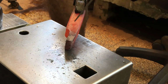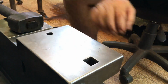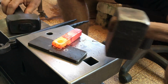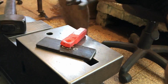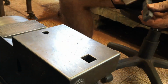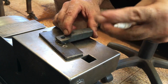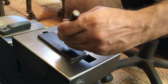I want to straighten out this little bit of curve at the top end. I want to attach the flat so that most of it is in contact with the anvil face and not over the hardy hole like my other one. I'm going to drill and not hot punch the flat piece so that I don't distort the bottom end.